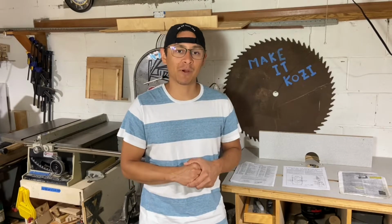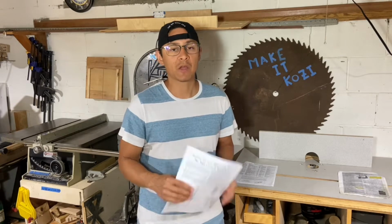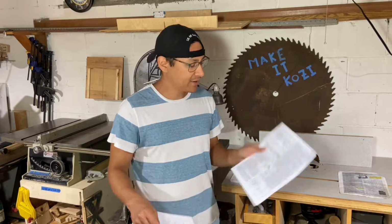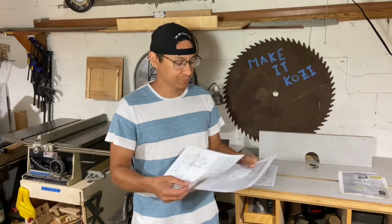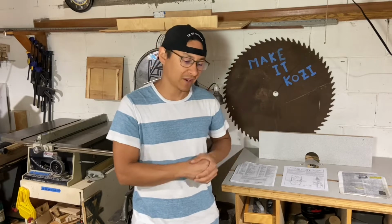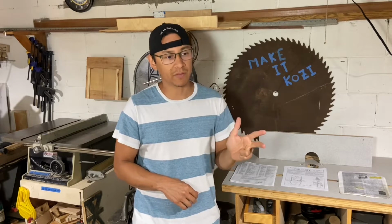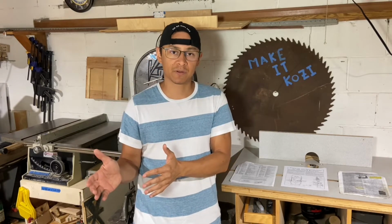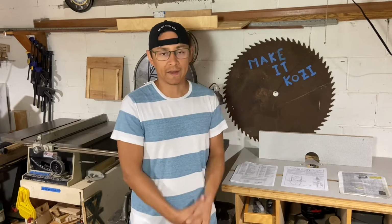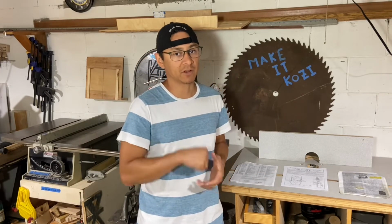Speaking of tech manuals and reproducible parts, I'm going to use the bandsaw for this next example, is finding stuff that's very reproducible, such as bearings. Right, so if you see my restoration video for this guy, you saw that I had to replace the bearing for the lower blade guide. And looking at the tech manual for this, if you go straight, serial number for that piece, it was like 20 bucks. And I was like, you know what, that's kind of discouraging for just a bearing. But looking at the inner diameter, outer diameter, and the width, I can take those specs, and I found a different person who sold them for basically 10 for 10, right? I get 10 bearings, $1 a piece, and I'm okay with that, right? Stuck it in there, it works just fine, everything's good. So that could also help you save a little bit of money as well.